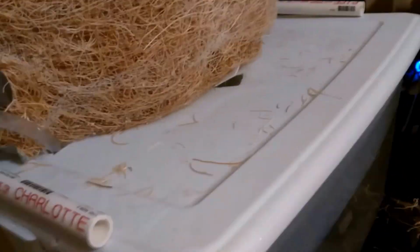Before, the water was falling off the sides, which is why I got all this crap here. But I believe that's been fixed. I basically added duct tape down the sides, and I also cut the pad a little bit smaller. And I believe that's largely fixed the issue of the water running off the sides instead of into the drain. Though there's still some work to do on that, especially around the backside. But there's totally cold air coming through here. The nights here in Arizona are still a little cold, so I'm not sure how well it'll work during the summer. I'm also going to need to find a way to seal off this window somewhat. Hope no one in the HOA complains about it.